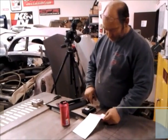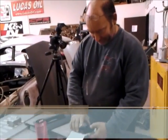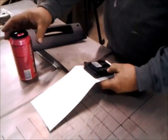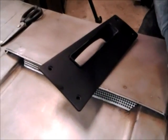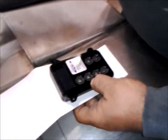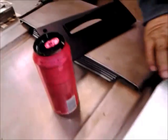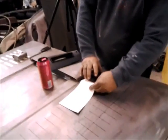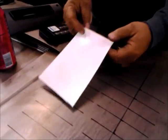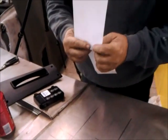Bill Richman here is one of the best fabricators in our area. He's been doing this for decades, and the mark of a good fabricator is that in his head he knows exactly what he wants to do. Here's the original shifter plate that goes on our console, here's the template he's using out of flexible cardboard, and there's the shifter from Powertrain Control Solutions. That's going to mount onto the fabricated piece, and we've decided to put a cup holder right there. He's mocking it out, cutting away and bending the template, because he wants to get it just right before messing with any metal — because that's when it gets serious.